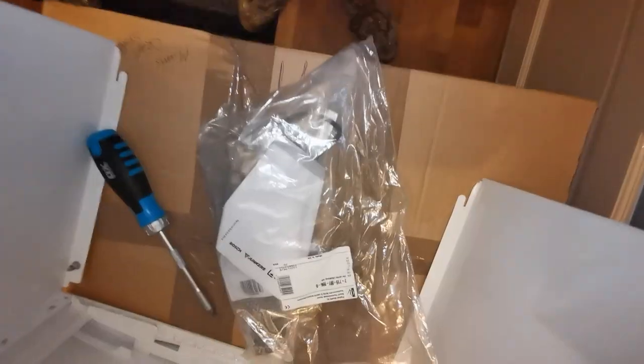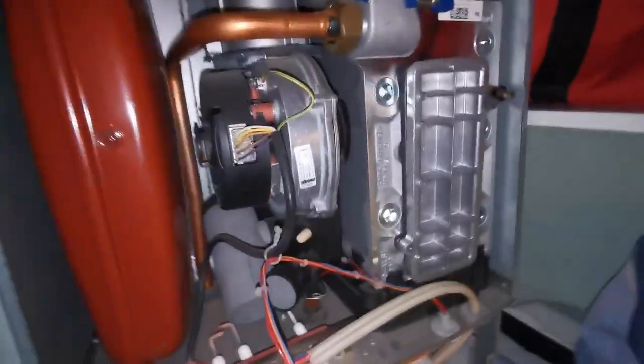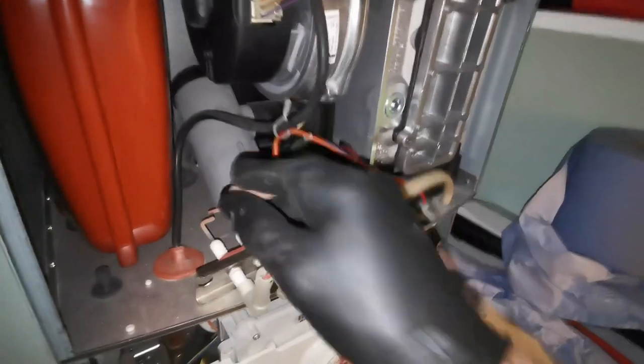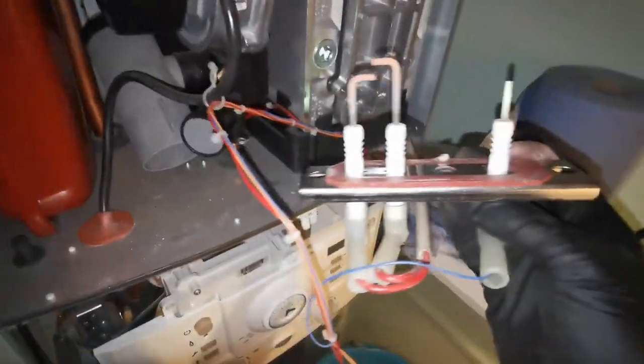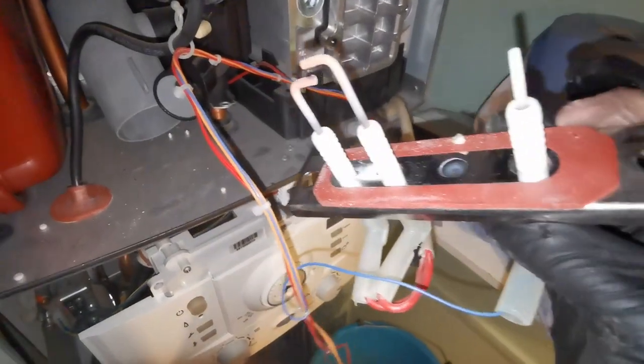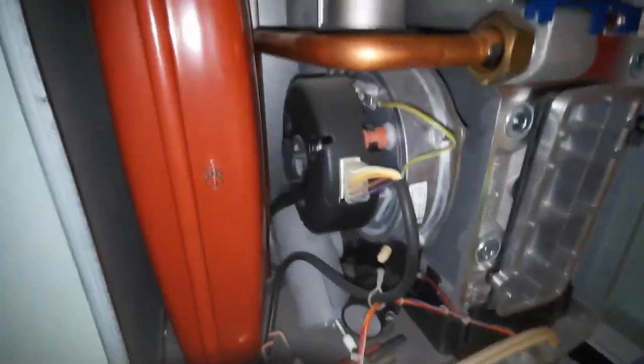There are also two nuts on the fan as well. I've got my burner seal kit with brushes. The electrodes are held on by two screws — whip that out, check the condition, and see if they need to be replaced. Check that red seal too — does it need replacing? Give the electrodes a clean up.